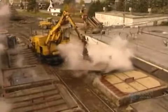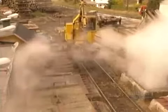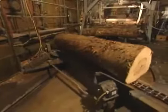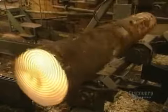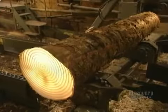The first factory makes the doors' plywood facing. They start by loading logs into steaming basins for 3 days. This de-ices them in the winter and softens the wood fiber. Inside the factory, the steamed logs line up for the debarker, a machine that removes the bark. The operator projects concentric circles and uses a laser to carefully center the log on the debarker.